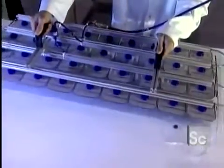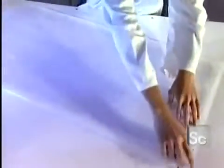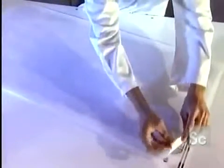Then they put on this transparent sheet of layered glass. It serves as a rigid transparent form which will support the modules. The superposing of parts forms a laminate that increases the rigidity and solidity of the panel. Finally, a sealing film is applied to protect the module.